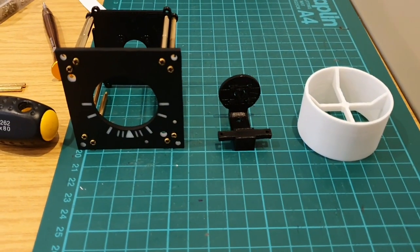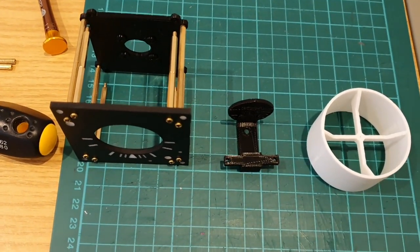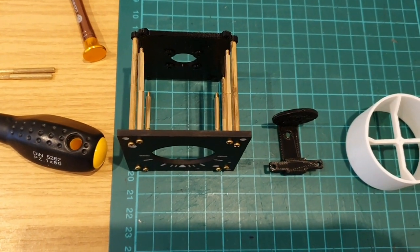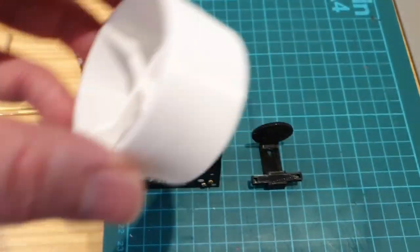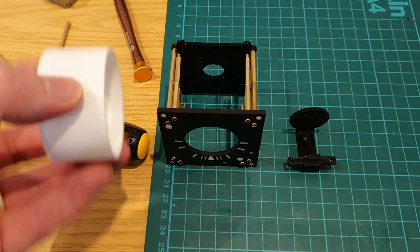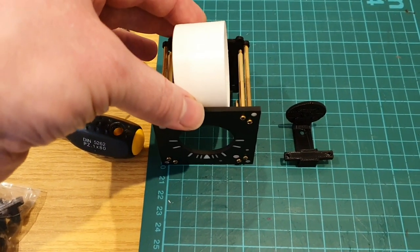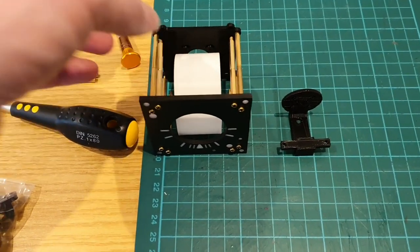The following steps are to 3D print some of the rear supporting layers, and I've just put in place the one we can see there which will hold the NEMA 8. I spent a bit of time to get the distance that it's mounted away from the fascia correct, so the attitude cylinder can sit snugly in place but rotate as it needs to.